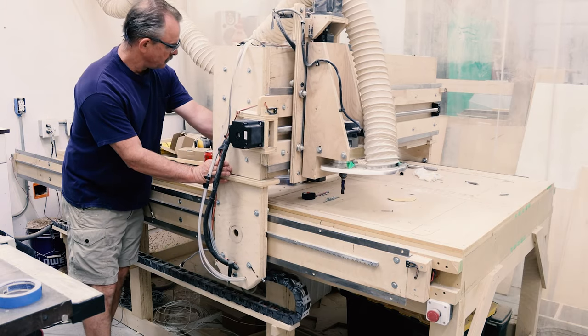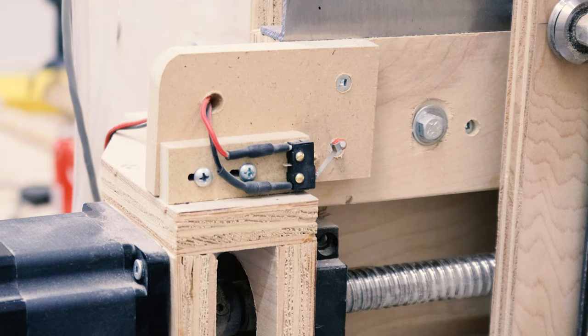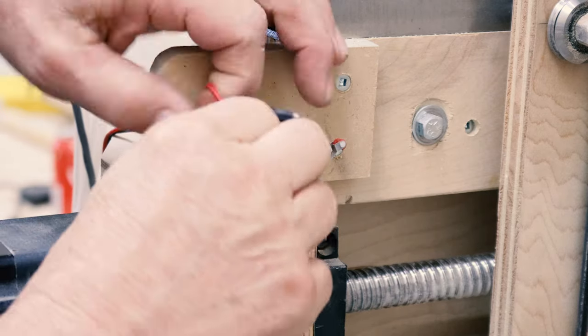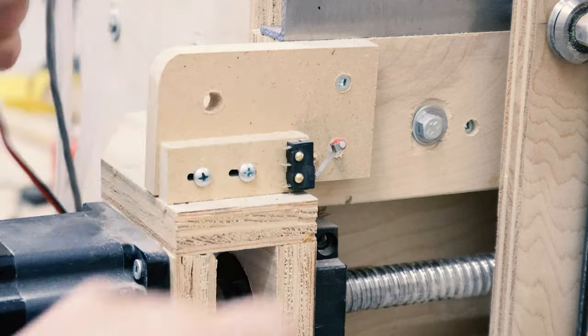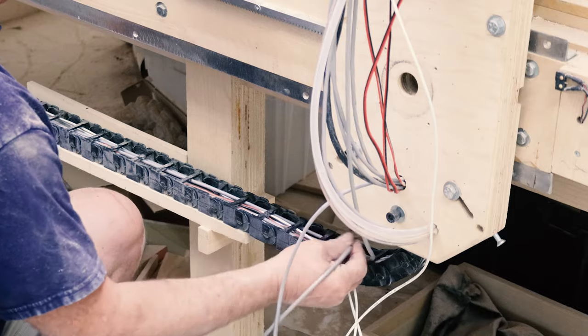While I was waiting for my new gears, I went ahead and did a little deconstructing and rewiring. I need to replace some non-shielded wire with shielded wire, which was giving me problems, and I got more wire to extend the communication cable to the encoder.